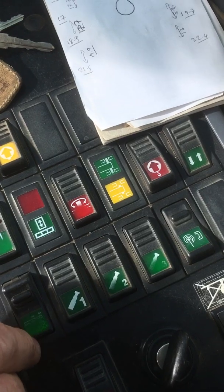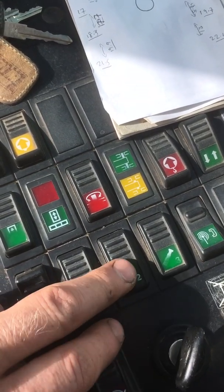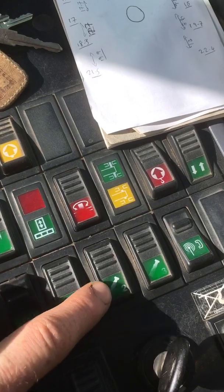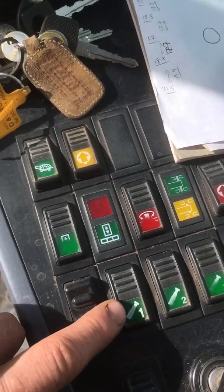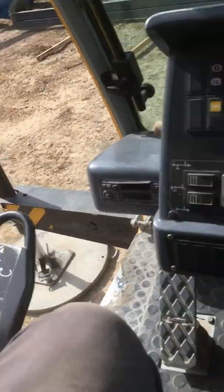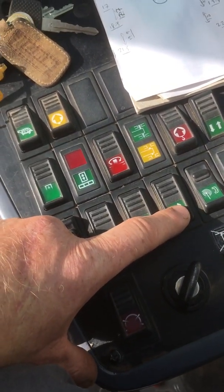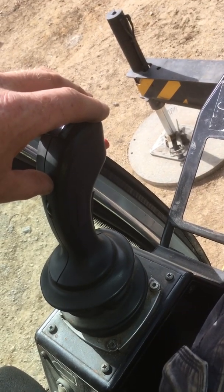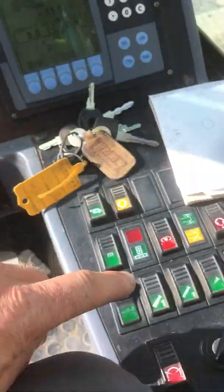Because it comes in out of sync, sometimes it'll only come back about 10% or so on one button, especially these first two sections — there's something not quite right. You might want to bring in the first section or push it out 10% or so. Pressing up pushes it out, pressing down brings it in. You click that button on and then use your tele out and in along with these buttons. If you wanted to bring the third section in, you press that button down and pull this in. You keep this button pressed while you're doing this, because if you don't keep it pressed, it will start coming in in sync again.